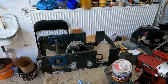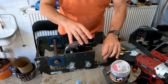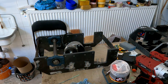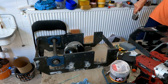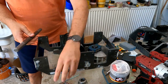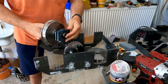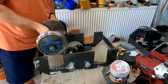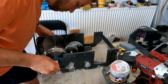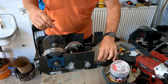Now you're going to see some build footage. The first clip is about dry fitting everything before I welded on the kingpin and the motor bracket. The motor is screwed onto the bracket but just held within the bogey. I wanted to get the wheels and sprockets in and work out the general alignment — how everything fits — and make sure I had enough chain length to accommodate the axles moving up and down.